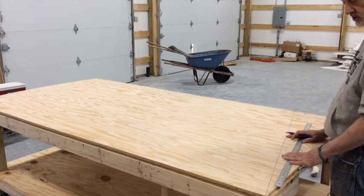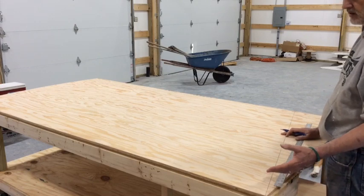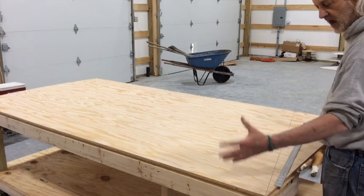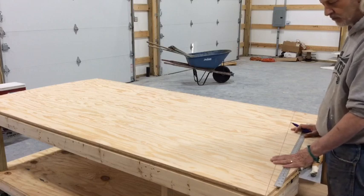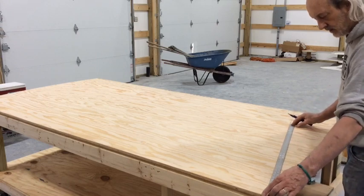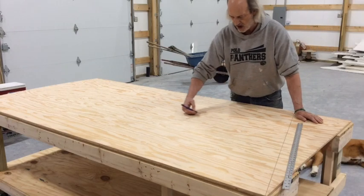How's the best use of this? I would like to get the rudder and the centerboard both out of one sheet, because the plywood was supposed to be doubled up anyway to give it double thickness. This is half-inch marine ply, and you've got to have two exact pieces cut out that are then laminated together, both for the centerboard and for the rudder. If I measure this way, I can waste a corner over here and get to 50 inches — so there's a foot, three feet, and 14 inches. I'm 50 inches this way and then I draw my rudder out in whatever kind of triangle fashion it is.